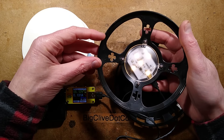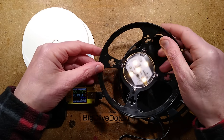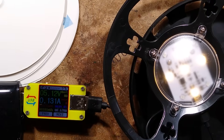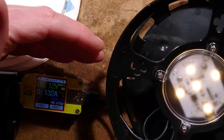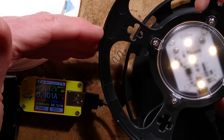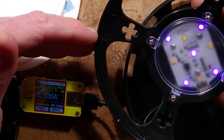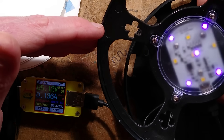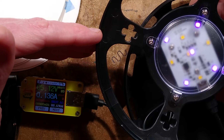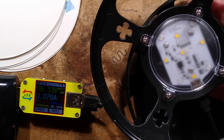It's designed really to be plugged into a wall socket. So there's the white and it's 132 milliamps. Let's focus on that so you can see the results. That's 132 milliamps. What's the next mode? Dim white which is 100 milliamps. Then we've got a deep violet at 136 milliamps - that looks quite deep actually, it's visible. And the lower setting at 100 milliamps. And then off and just 76 milliamps again. Why is there such a high standby current? What is this doing?